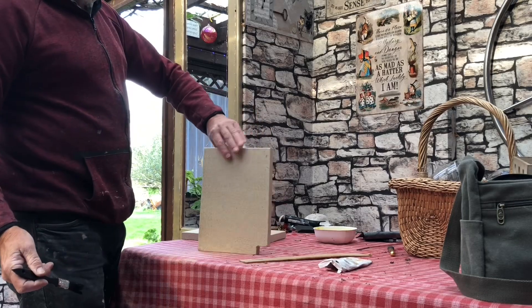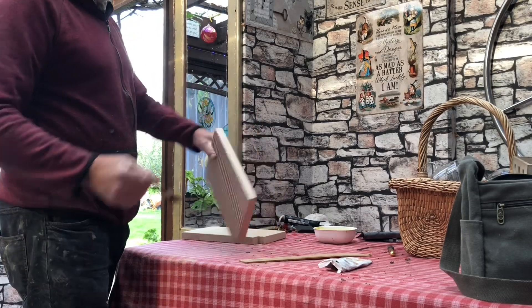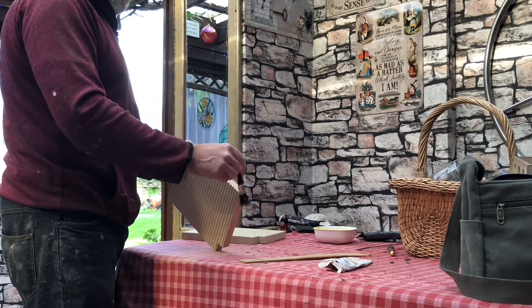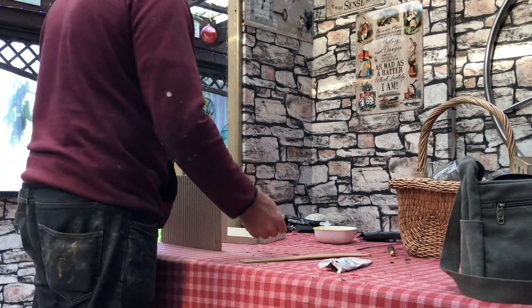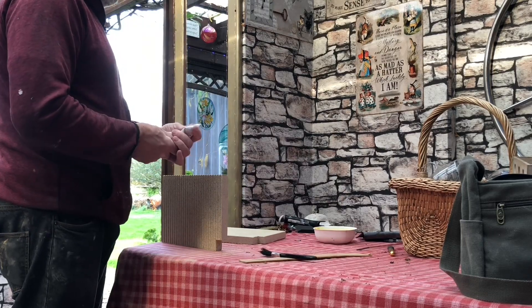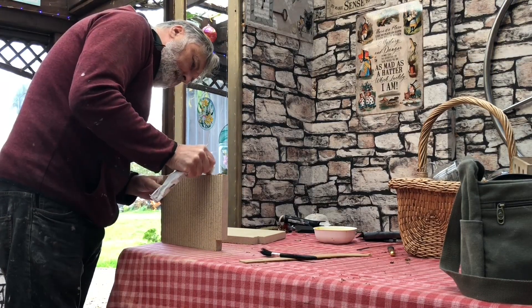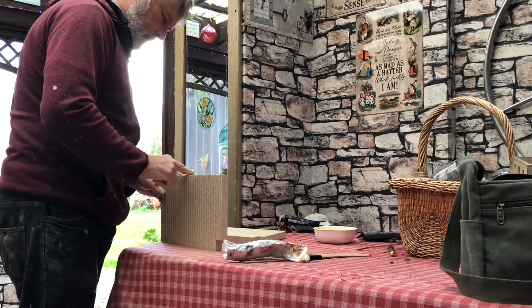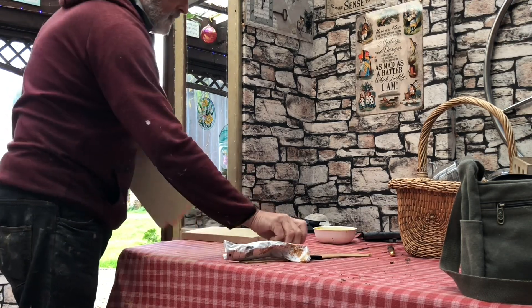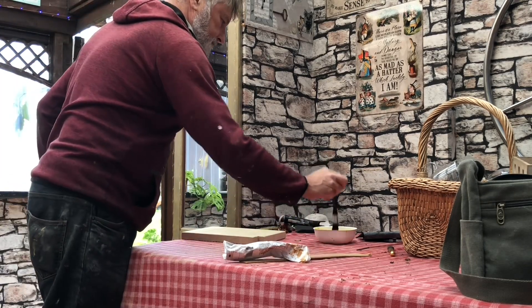Just make sure the glass is clean — wipe it, a bit of water, turpentine is better. The most important thing is just to do one clean cut. So I'm going to glue the vermiculite together — I'm not going to glue all of it, but certain components. The best way, as per instructions, is to wet the edges before you apply the glue. It's a very pleasant material to use. The glue — I'm not sure how it's made, I believe it's some type of clay and water glass — but it's nice and creamy, and it certainly does stick. Once it's heated up, it really does work very well.